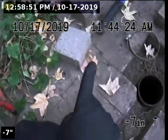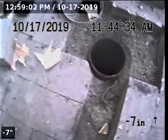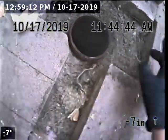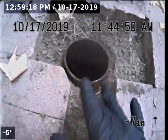That one was right there. And then it had this cinder brick just kind of sitting on top. So I've already let the potential buyer know, but I would recommend removing this brick, digging a little bit right here, probably about 8 inches to a foot down, and putting in a concrete sewer box that is flush with the bricks. And then you can backfill the dirt around the sewer box, and then you can cut the bricks to make them fit around the sewer box. So that way there's easy access in and out of this thing.